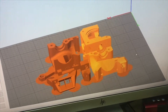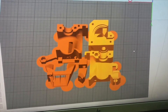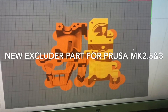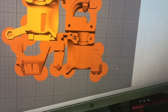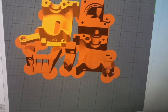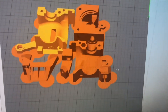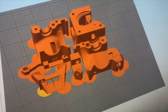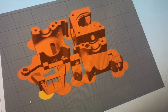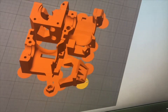On the screen you can see the Prusa MK3 or 2.5 new extruder part. It looks similar to the old one. The main difference is the front fan is tilted to a certain angle, giving more airflow to the hot end, making it print more beautifully. Another difference is the heat sink part also got more airflow.